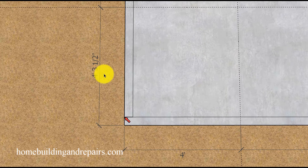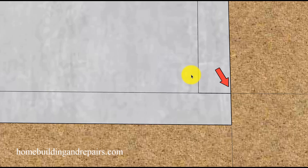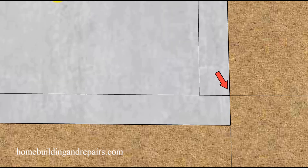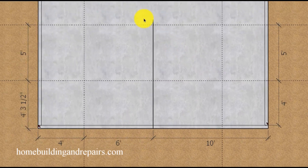This is where we are going to line up the end of the roof rafter. It wouldn't be a bad idea to draw some type of an arrow — maybe grab a pencil, chalk, or paint so that you're not confusing one point with another. This point right here will connect to this one here, and this point will connect to this one here.